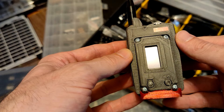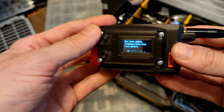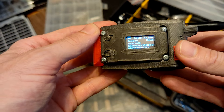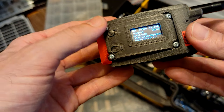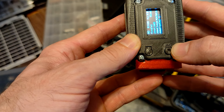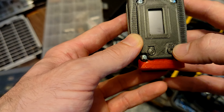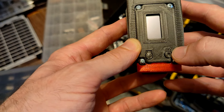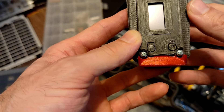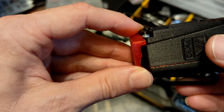I also added a MOSFET. The telemetry sensor and GPS sensor work great. I added status light drillings — I made two holes and used transparent filament as optical fiber, so you can nicely see when it's charging and the breathing light or status light in general.